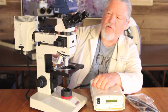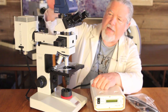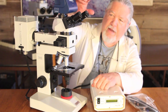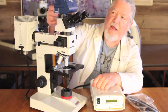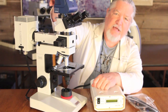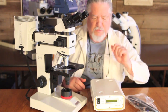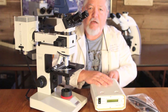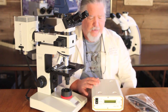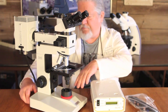This is the vertical illuminator, which we'll talk about with the lamp housing. Here I have a binocular head with a trinocular port — so this is actually called a trinocular head — and I have a camera here for capturing digital images. First things first, we will unplug our power supply and let that cable go, then unplug the microscope over here. Now there's no danger of any electricity coming through and shocking us.